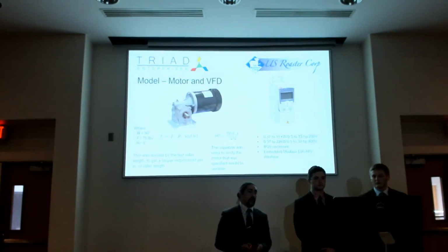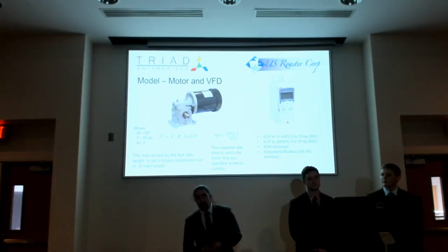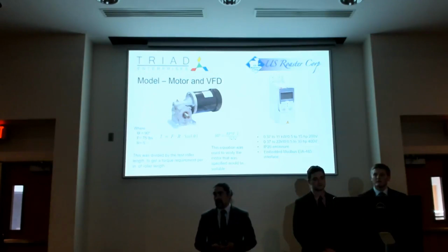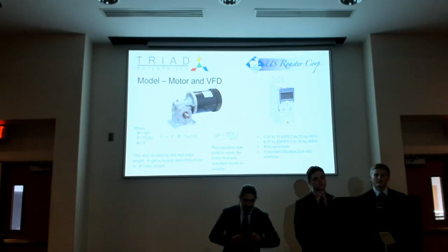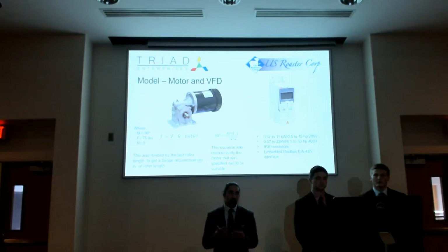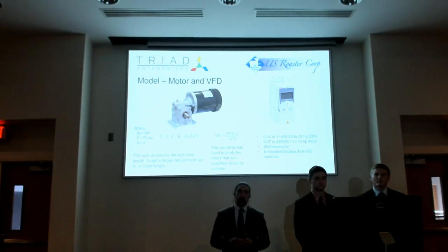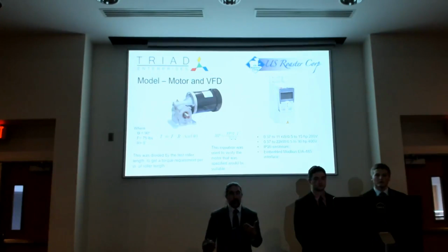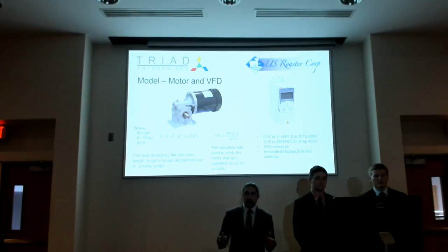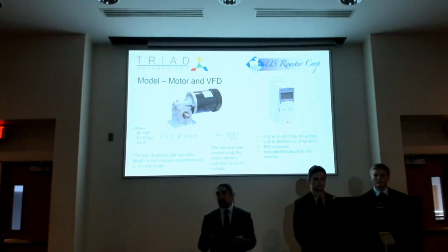Moving on beyond that, to drive our rollers, so to spec out our motor, we took our roller mill that we had access to test with, and we loaded up the rollers full of beans as a worst case scenario, and then pulled up on it to see how much torque was going to be required to power through fully clogged rollers. We then decided how much torque that required per inch of roller, scaled it up to our 12-inch rollers, and we came up with a number of around or greater than 600 inch-pounds of torque would be required.